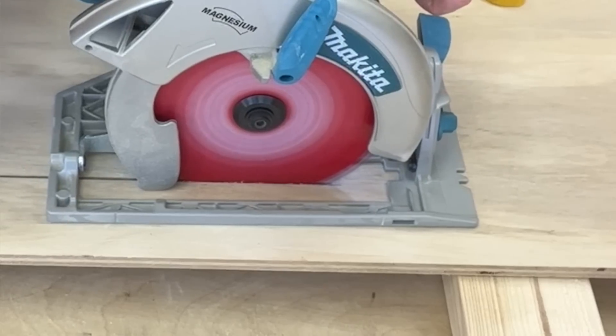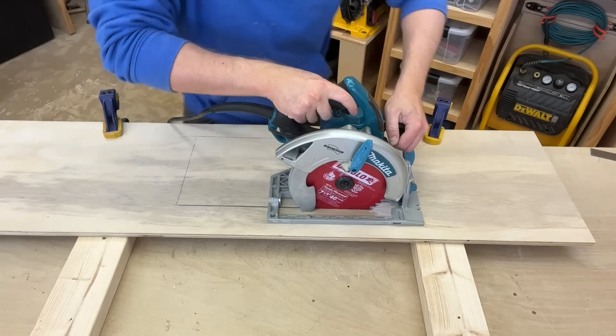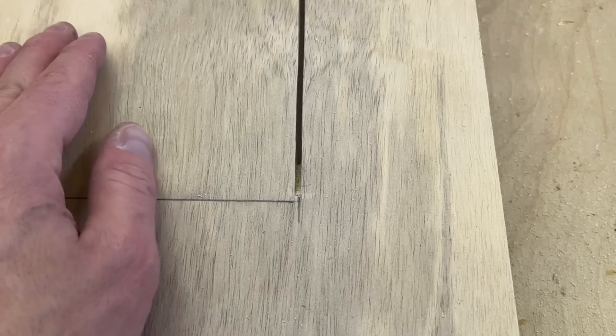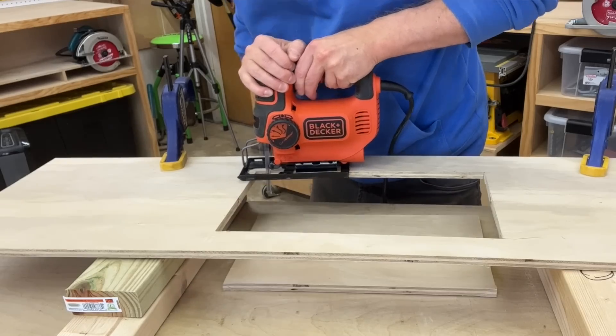When your sole plate is sitting flush on the material, you can release the blade guard lever or keep it lifted — it's up to you. Begin driving the saw forward along the cut path, just like a normal cut. If you reach a cross mark or a final point, just stop as you touch it. When you're done cutting, let the blade spin down, then remove the saw. That's how you make the whole cut. If you wind up with inside corners, you can just finish them with a jigsaw or a handsaw.